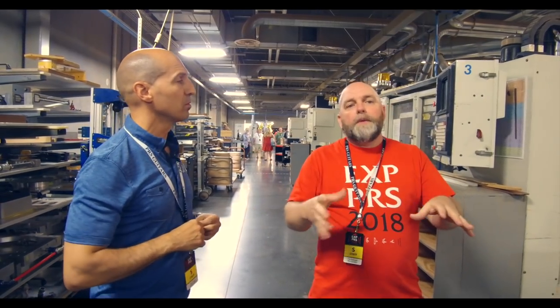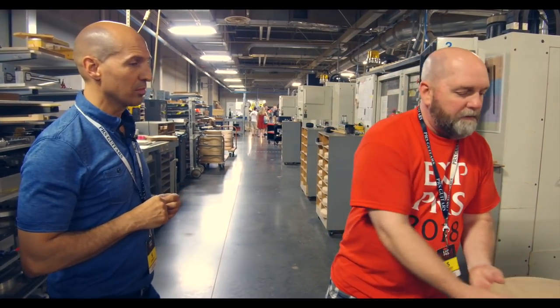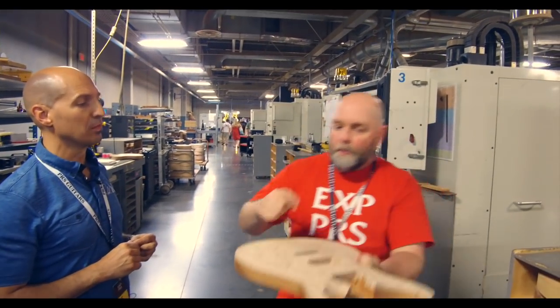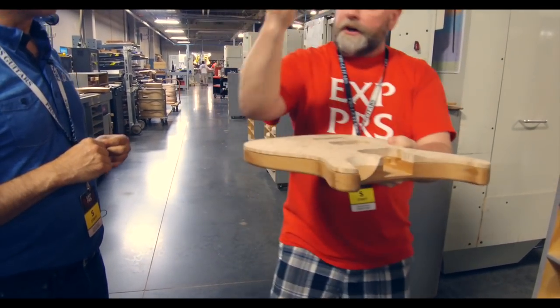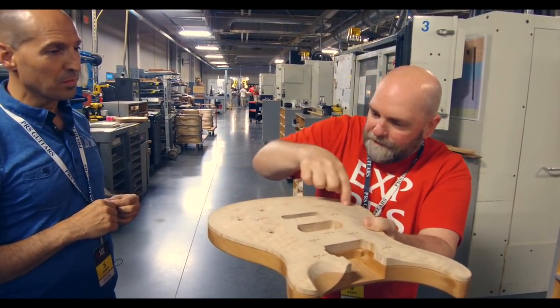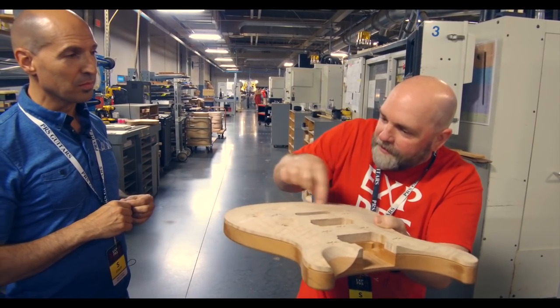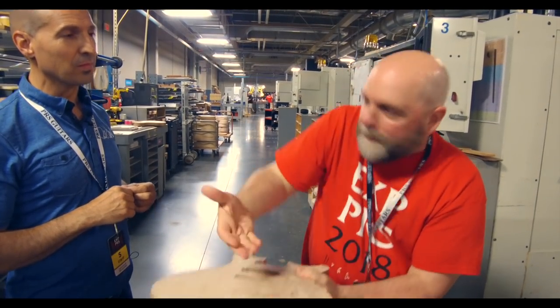Before we had the CNC, we had to actually make the guitar first. So the way they would do it is we would have private stock people, as well as Joe Nags, who formerly was here. Joe Nags and his team with Paul would basically hand chisel guitar tops. And the way they did that, I'm not sure if you all are aware of it, but a guitar top starts off about this thick. And what they would do is they would draw, almost plot it out like it was a map with little rings. And they would put it on a drill press and literally plunge cut. This would be more deep, follow all the way around the line, and then it'd be a little less. And they do these plunge cuts with the drill press all the way around. Then they take a chisel and go, beep, and then it would knock it out.